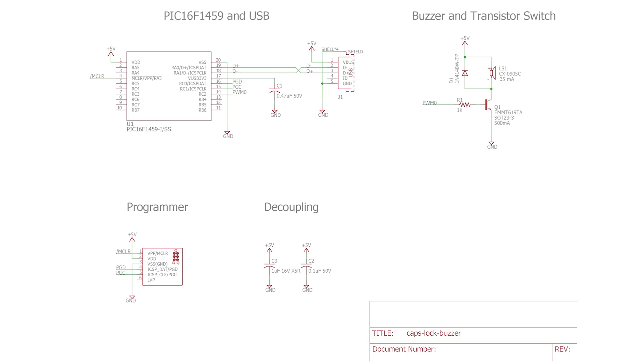The first is the microcontroller setup. Can you talk through the microcontroller you used and why? On previous USB projects I was using some Microchip PIC 18 microcontrollers — really cool parts, really small packaging — but they require an external oscillator. Normally if you're going to do full speed USB you need a 48 megahertz clock source. To get that I had a 12 megahertz oscillator on the board and then a PLL in the chip that would take that 12 megahertz and ramp it up to 48 megahertz.